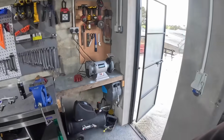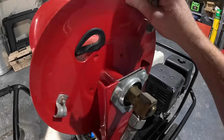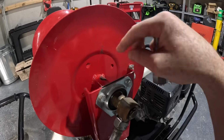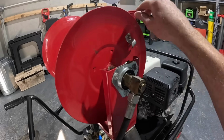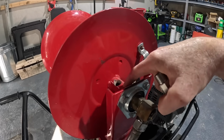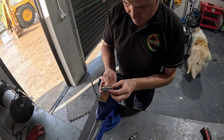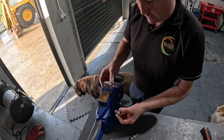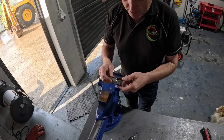Anyway, I had to run down to the local car shop and get this fitting here. When this pipe comes up here, there's a 90-degree bend that goes down into that pipe, and it allows the pipe to stay within this radius so that when you turn it, it doesn't catch, if you get me. I know that's sitting somewhere, and I know I hid it really well, hence the reason I can't find it. I wasn't able to get a 90-degree bend. I could only get this T here, and I might not have to change this. This might be 100%. So I need the plumber's tape, and what I'm going to do is just stick an end cap on here, a blank cap, and that leaves us with a 90. It should be the same thing.